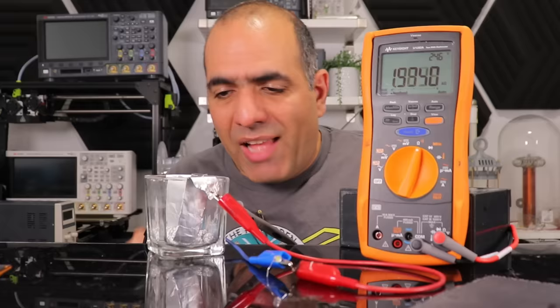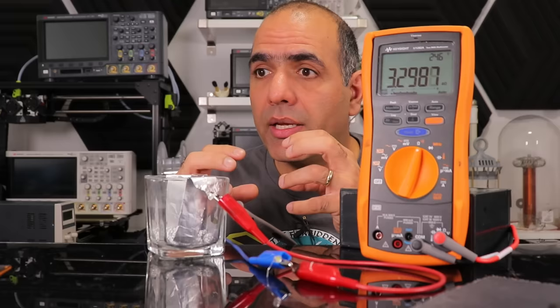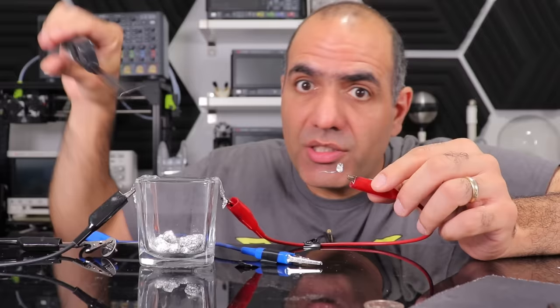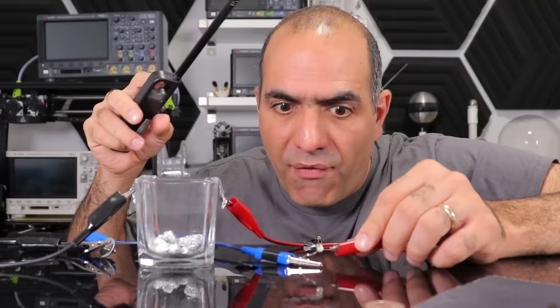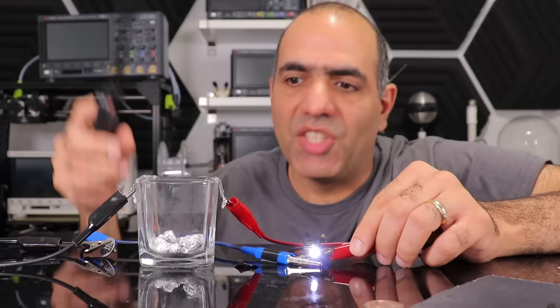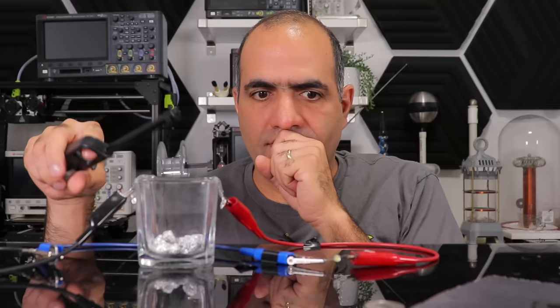What a phenomenon. The required voltage changes significantly with weight, volume, material, environment, and other factors. We need a pulse of higher voltage first to make the connection, and then the 3-volt power supply to maintain it — but do we even need a power supply to maintain the connection? I connected the 3-volt battery back, the LED is off and disconnected so there is no voltage across the coherer. If I connect it back and click, the LED turns on. But if I disconnect, click, and reconnect — the LED turns on. Disconnect, reconnect, disconnect, click, connect — turns on. The coherer creates a stable continuity without a need for a power supply.